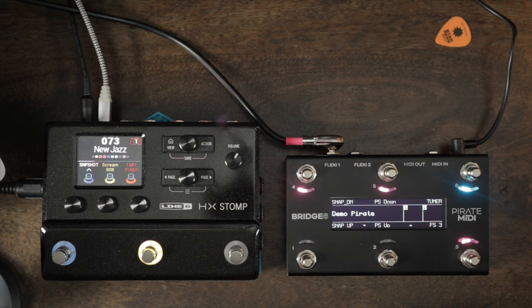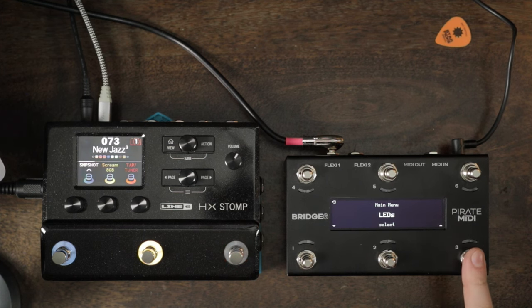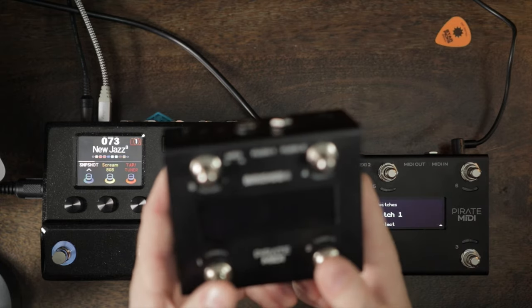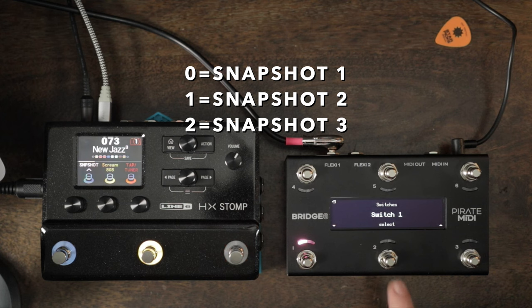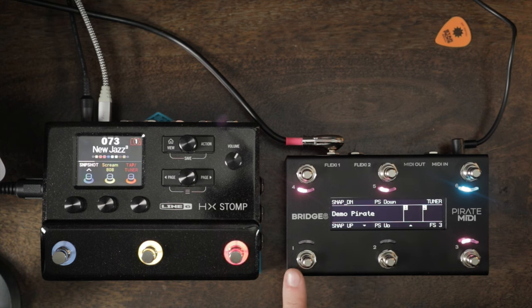Let's figure out how to scroll through snapshots on the Bridge 6. To get to the menu, you hold down foot switch one and four, which brings you to the main menu. On the Bridge 6 you use foot switches one and three to scroll through menu options — same on the four, you'd scroll using one and two. To select something on the Bridge 6 you use foot switch two in the middle; on the Bridge 4 you hit both switches. To pull up snapshots you need to send a CC message of 69. One option is to call up snapshots one, two, three with three different foot switches using CC 69 with values of zero, one, and two.